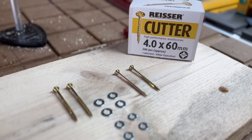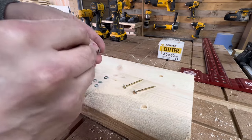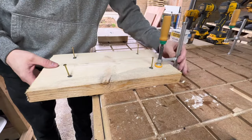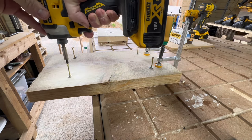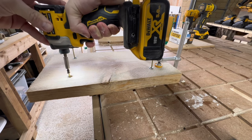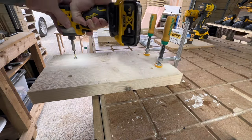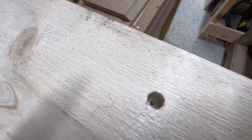In preparation for securing the top to the legs, I'm using two different size washers — 12mm and 10mm. Put the 12mm washers onto your screws. Now you might be wondering why I'm using 12mm washers when my countersink holes are also 12mm. This is a neat trick — secure your workpiece to your bench with two of the holes overhanging and carefully run your screws through the timber. This drives the stainless steel washers to the bottom of the countersink hole. Scaffold boards are made from softwood, and it's very easy to pull a washer through the timber. Having a washer the same size as the countersunk hole gives us a firm anchor for the second washer, reducing the risk of damage to the timber.